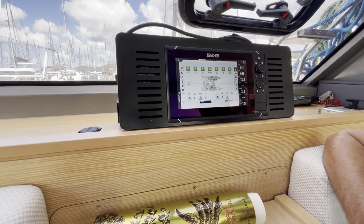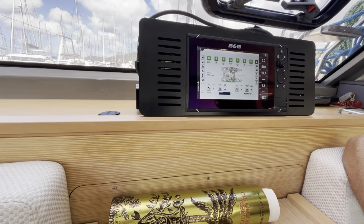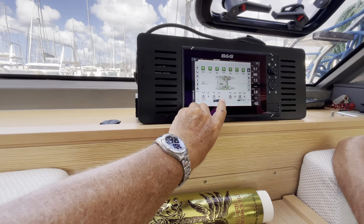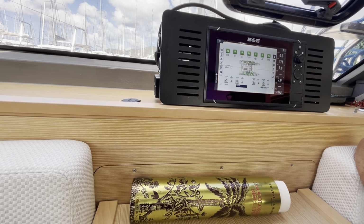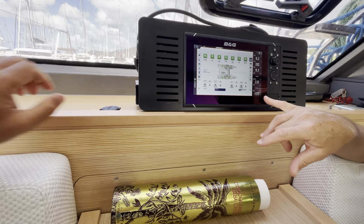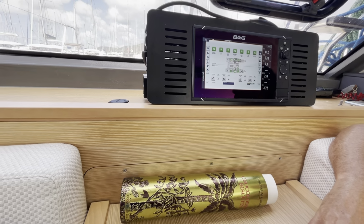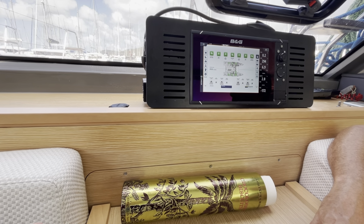We'll talk through the bilges in a second, but I mentioned that if someone leaves a shower on, the excess water flows into the engine bilge. The switches on the bilges in the main hulls are float switches, which have been extremely reliable. The switches on those are sensors, and they're not completely reliable. But you just come here and turn it off. It'll turn itself on. So when I say they're not reliable, they're reliable at turning on, but they're unreliable at turning themselves off. You will hear the pump running, you'll see the water coming out, the water will stop, and the pump keeps running.